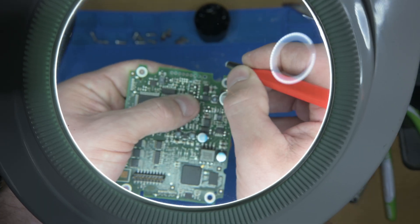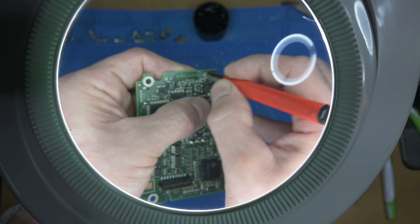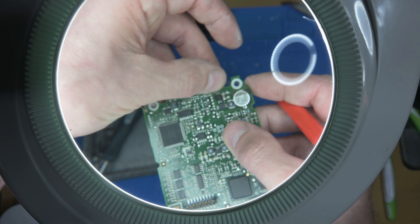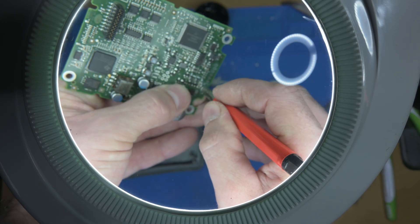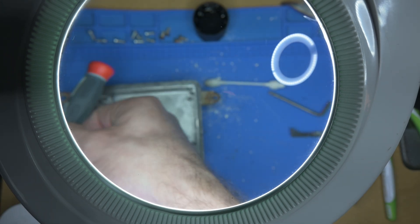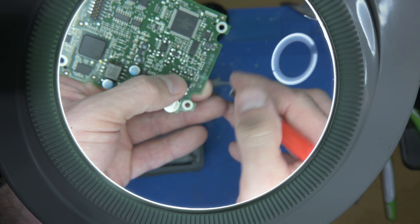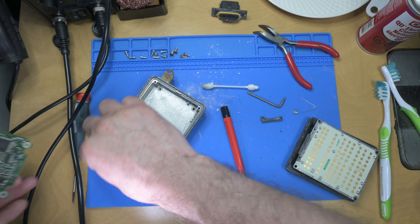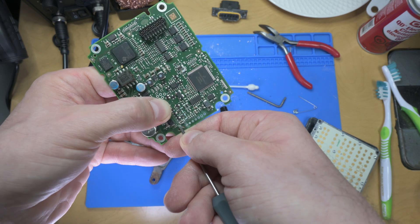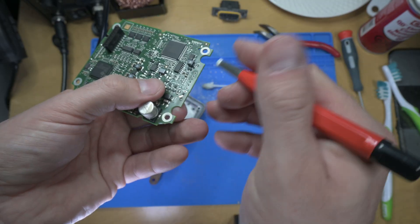You have to be cautious removing enamel. I tried this on a laptop once but I didn't have this fancy fiberglass pen — I used a little bit of what I thought was fine emery cloth. Long story short, I ended up having to buy a new keyboard for it. Those flexible circuit board wire traces are very very thin. I could solder my jumper directly here, and that would still keep it attached to everything else. Let's try the trace first, because if I screw up up here there's less consequence. Okay, I'm starting to see bits of copper through the enamel. This is a pretty thick copper trace so I'm hoping I can get away with this.